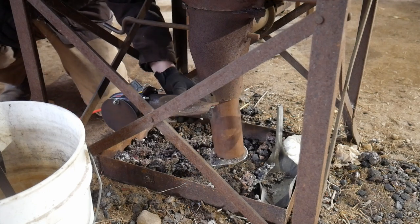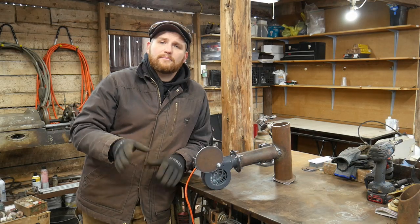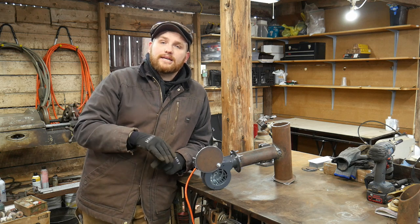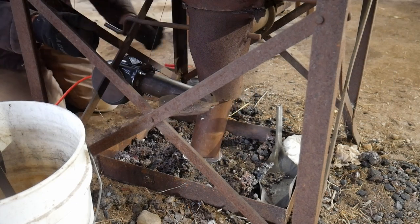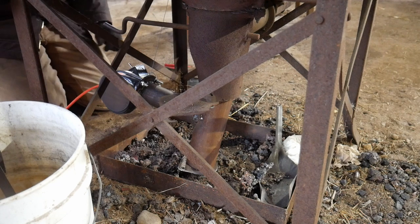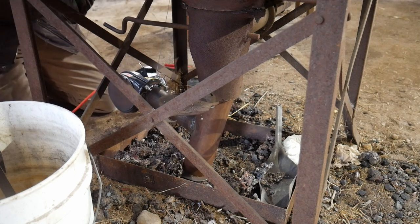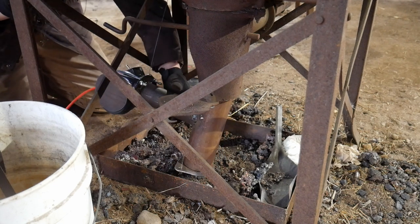That'll bring me to my second question I get all the time, and I'll just try to answer it in this video real quick. People ask, which do I prefer, electric blower or hand crank? I prefer hand crank, but right now, in the setup that I have, I do not have a way of venting out the coal smoke. So I am using coke, which does not off-gas the harmful sulfurs and sulfur dioxides and things like that that come out of coal smoke. So I don't have to worry about that in the shop.